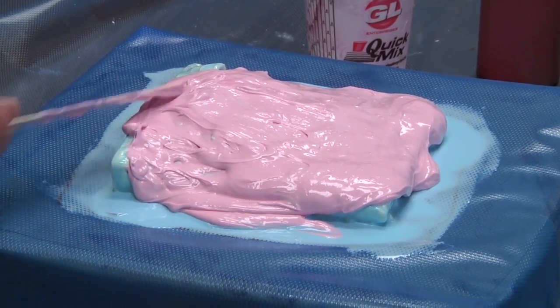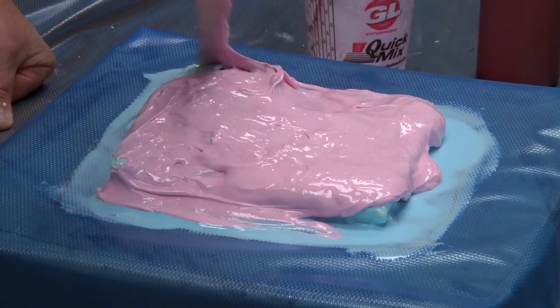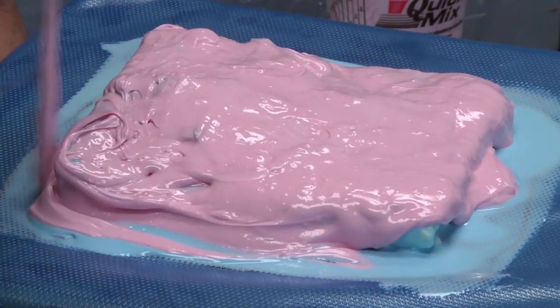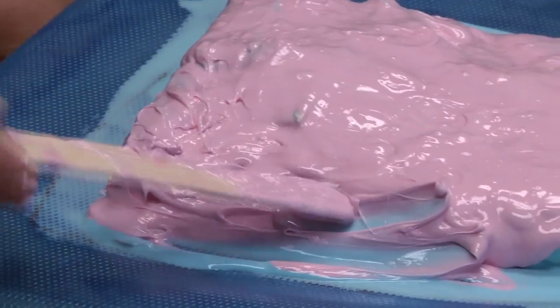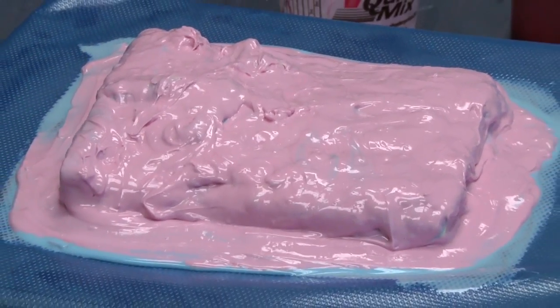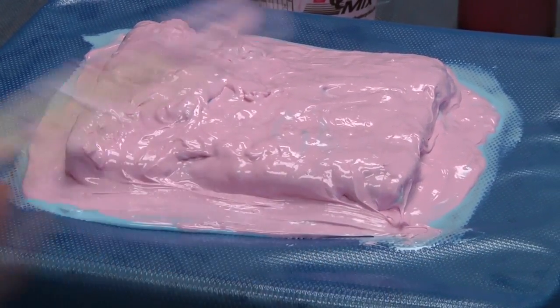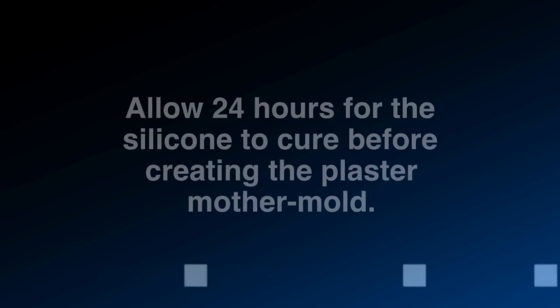You can also take and pre-mix the 1300 THB with the 1328 and let it sit for a period of time to get a little bit thicker mass to the material. This coat was applied at 60 minutes. The next coat will be applied at 90 minutes and a fourth coat at 120 minutes.